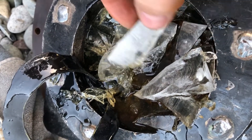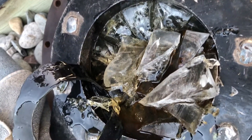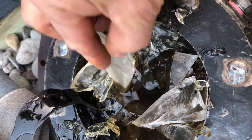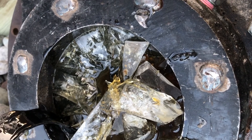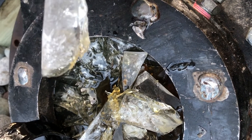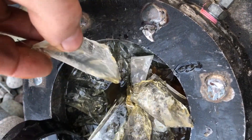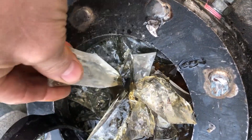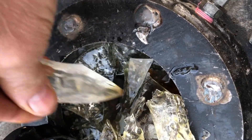Okay, well there you have it. I'm going to have to check the video but I think around 1,300 psi. To be honest, I don't like the way this broke. I've tested acrylic windows before and when one broke it simply cracked — this is catastrophic. I have to do a little research on how acrylic is actually destroyed; I have a book that'll show me that.